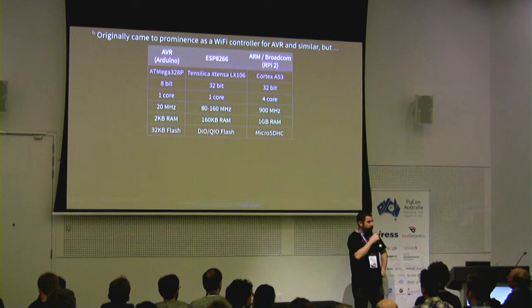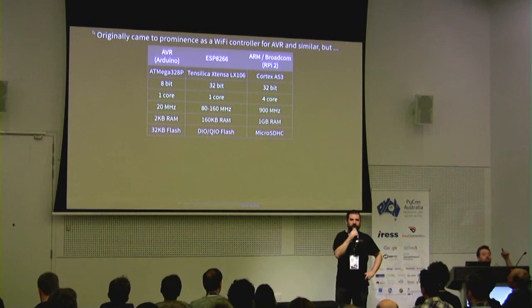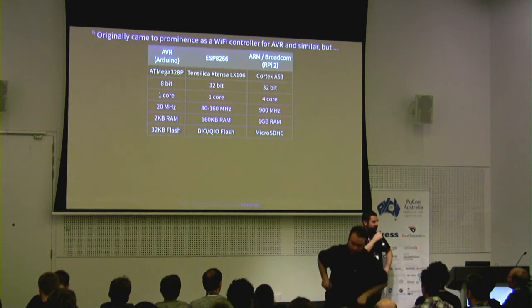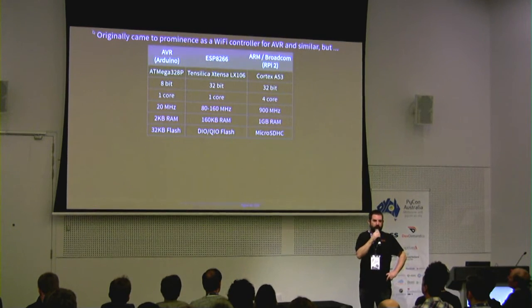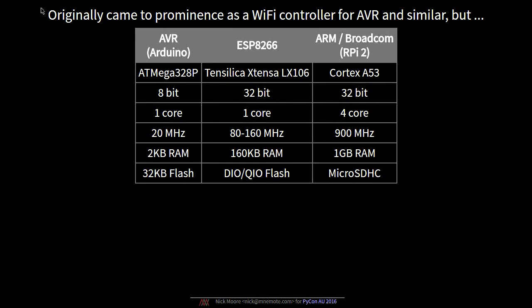In short, it's a 32-bit core — there's only one of them. It can run at 80 megahertz, or if you like wasting batteries, it can run at 160 megahertz and wait for its flash the whole time instead. There's only about 160k of RAM on board of various types, which is very limiting, and normally it's coupled with about a four megabyte flash where all the actual software happens. Espressif's system manages to control that quite well, paging stuff in and out without too much intervention from the programmer.